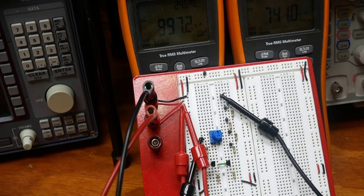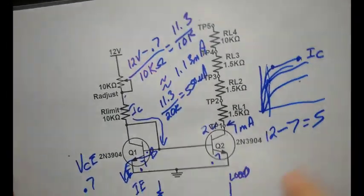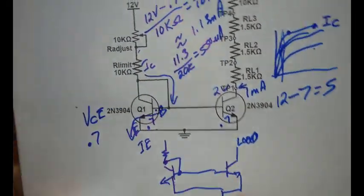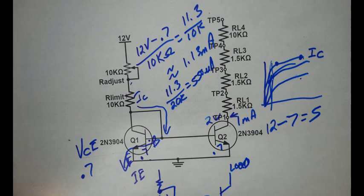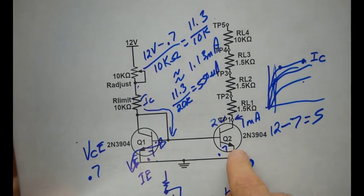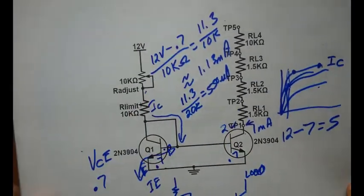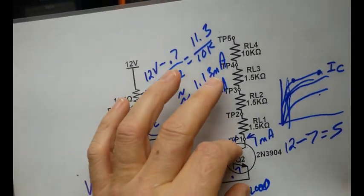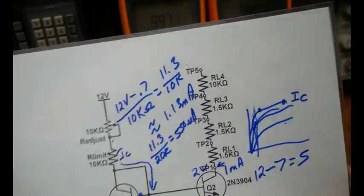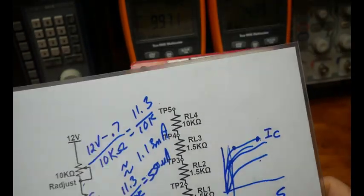So the point of this whole thing was that I looked at this circuit online and decided I don't think it's going to work the way it's always drawn. Adding emitter resistors — low value — stabilizes the current. The currents are going to be the same on both branches; they're both 100 ohms with the same 0.7-volt base-to-emitter drop. So the voltage drop from the base to the emitter including the resistor is going to match on both sides. We get a much more stable circuit and a much closer tolerance by adding the emitter resistors.